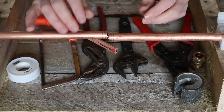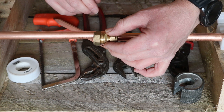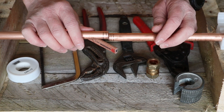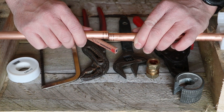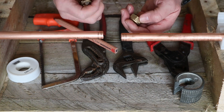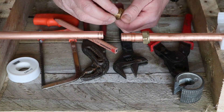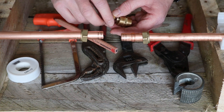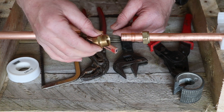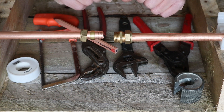Once you've cut the pipe you'll have two ends of copper. You need to get them over either side of the compression fitting. I use a technique I call 'playing the pipe' — just move the pipes to the side to fit the fitting into the gap, then close the gap back up. First, put the nut over the pipe, then the olive, mirroring this on the other side. Then make one side up first — push the fitting up to the line and screw up the nut.